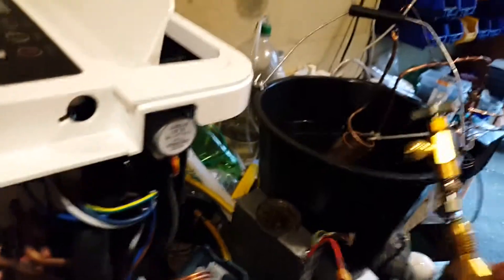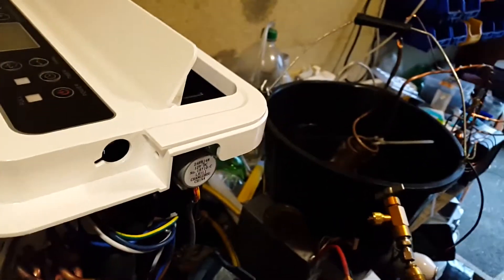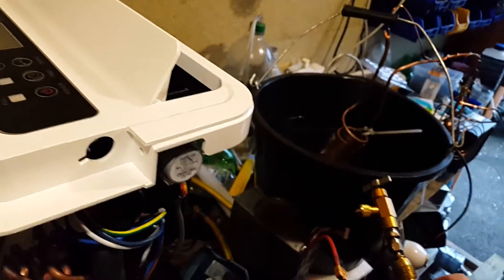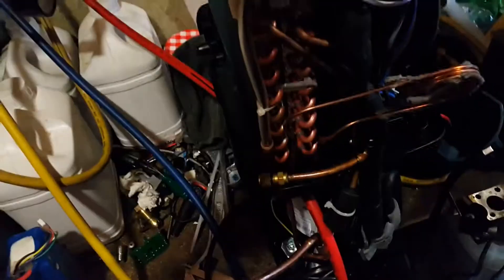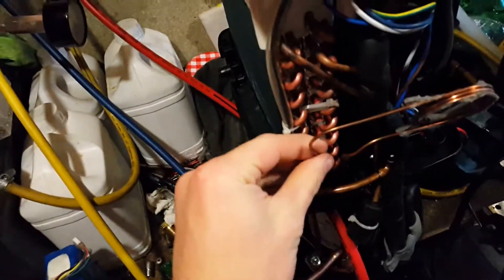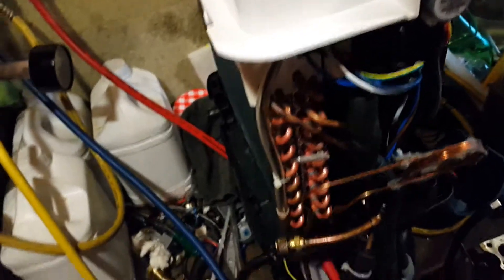So I'm going to try charging as a liquid. Now the problem with that is the valve and hoses freeze up, and then the connections start getting really loose, so I'll just have to do it very slowly. It's got CO2 in it just now at pretty low pressure because I've purged it out. I'm also going to put a filter dryer on it, but I think another issue may be that I've maybe partly blocked up the capillary tube too.